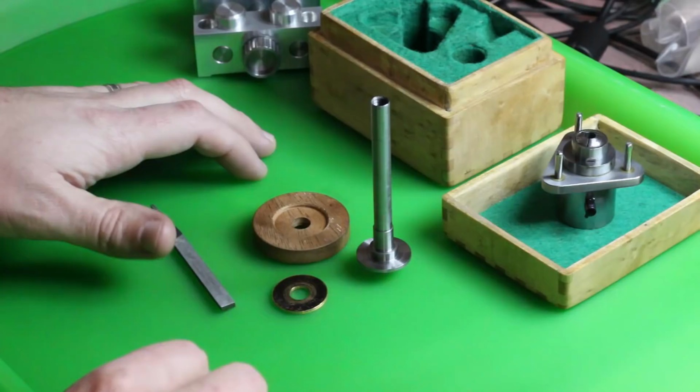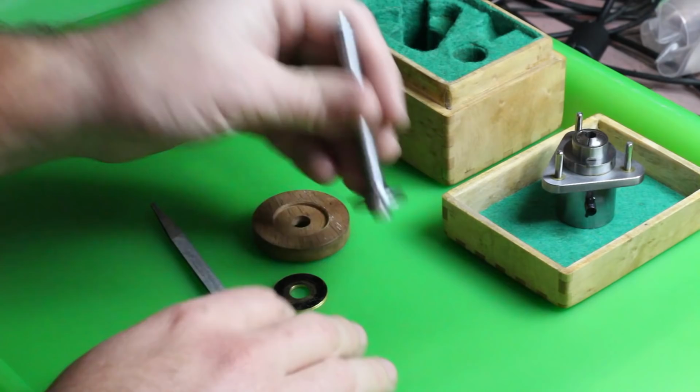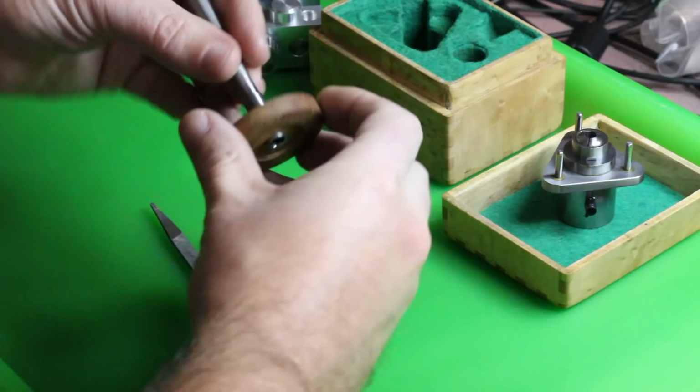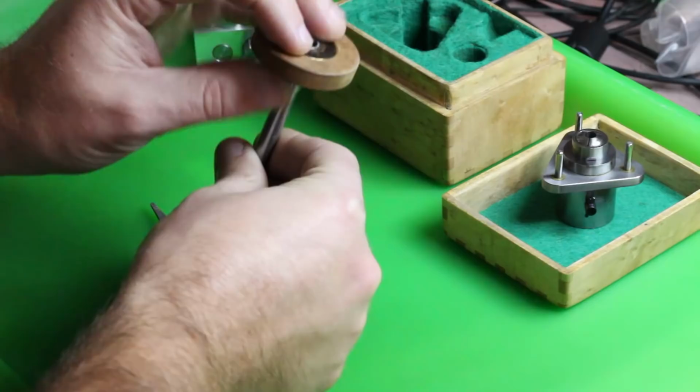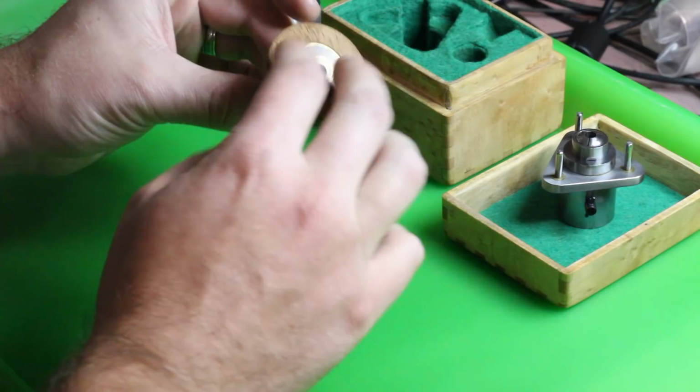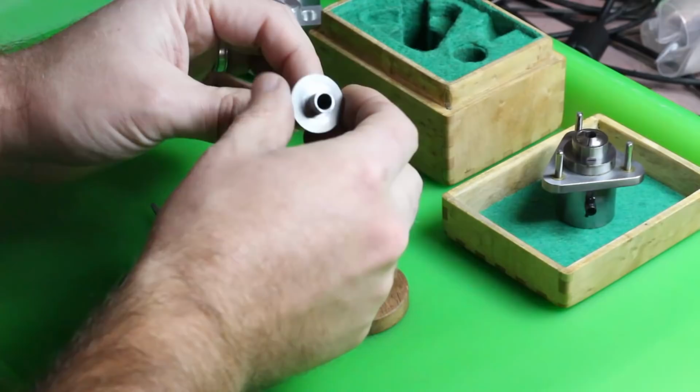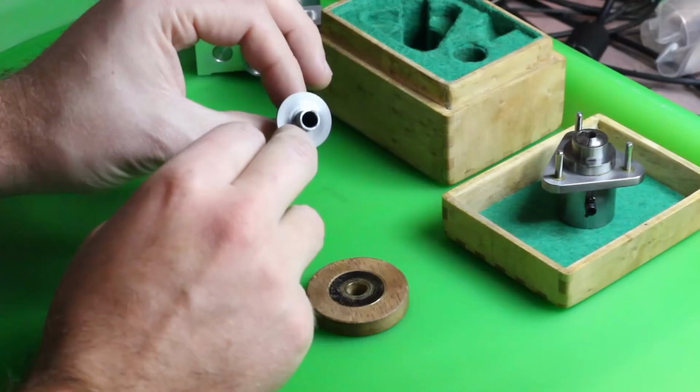So I've got the dividing head set up in the mill in a vertical orientation to drill the three screw holes through all these components to keep them held together. And I have a little bit of an issue figuring out how to retain them together so that those three holes can be drilled through all pieces simultaneously. 3 millimeter clearance holes through the brass retaining plate and the wooden handle, and then smaller holes to be tapped through the tube itself here.